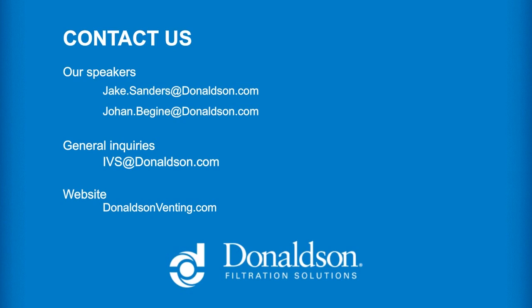In some hybrid applications, there may be other battery technologies still in use, and those could potentially use more simple venting with just a membrane, not requiring the dual stage feature. Thank you very much. Another question here. How is the dual stage system affected by temperature? Recognizing that PTFE has a melting temperature of 325 degrees Celsius, and a thermal runaway event can reach temperatures of 1,000 degrees Celsius at the source.